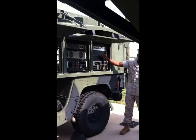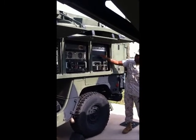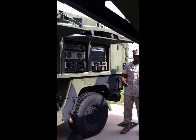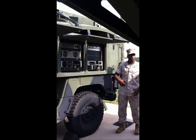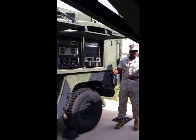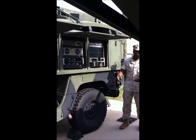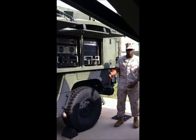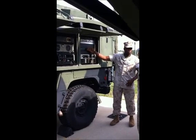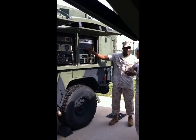The fiber optic modem is really simple. The five fiber optic connections on the signal entry panel all go here. What it does is take that fiber optic signal and convert it into an actual balanced NRZ signal. That balanced NRZ signal goes to the ETSS-P, and at the ETSS-P that signal is multiplexed together and created into another balanced NRZ signal — or kept the same, depending on whether it's balanced or unbalanced coming in. Balanced NRZ comes out to CVMCU-2, and ETSS-P utilizes balanced NRZ, though you do have such a thing as unbalanced NRZ.